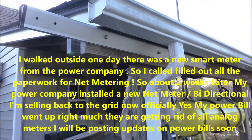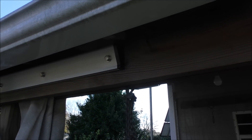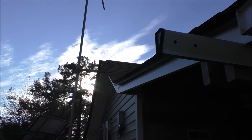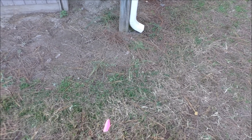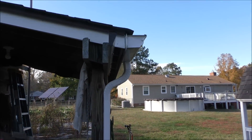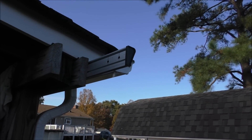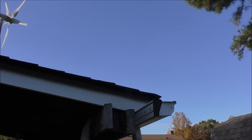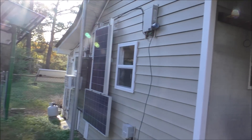Anyway, this is my standoff post. This is IronRidge with 3/8-inch stainless steel bolts and end caps — it's a standoff, just like my wind turbines. This new mount is going to stand right there going to the ground — concrete right there, four feet in the ground, a 12 by 48 inch tube, straight up and U-bolted right to that standoff. It'll be a two-and-a-half-inch stainless U-bolt. It'll be above the roof line — almost a foot and a half — because it's about eight feet to the top of the roof and I'm going 10 feet. Here is our pole.